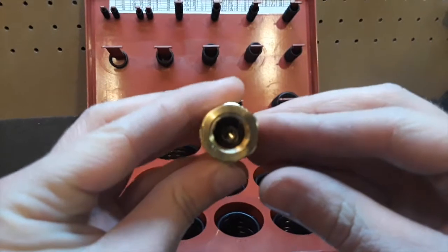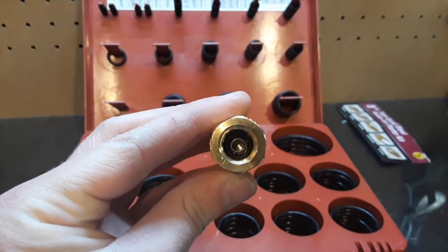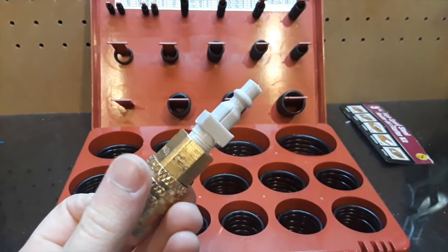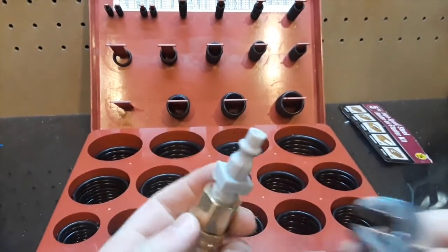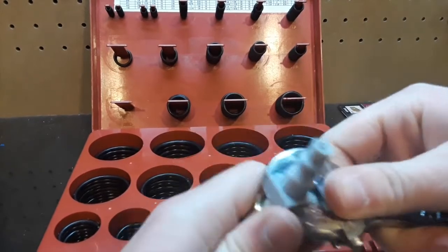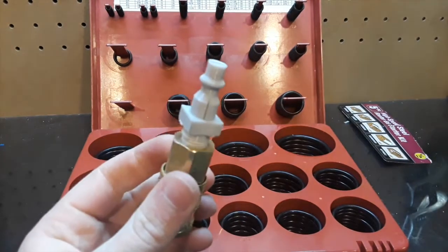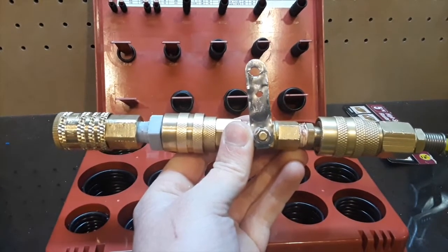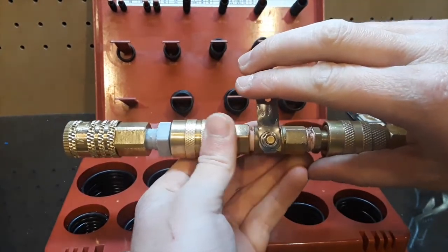Here is the o-ring at the bottom of the female adapter. I'm going to screw it on and see if it works. It went on pretty easily and I have it just about all the way in. I don't want to push it anymore because I don't want to strip the threads — they're plastic and fragile. Here's our pressure test at 50 psi.